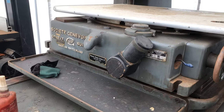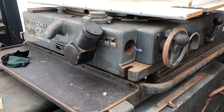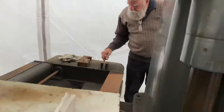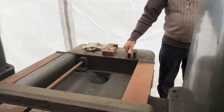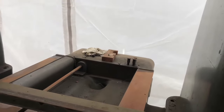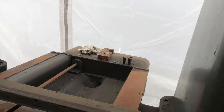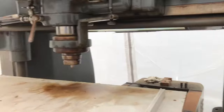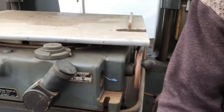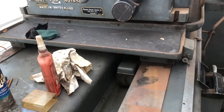Now before I do anything else I'm just going to get a squirt of lubrication, which is down the back here — those three handles, just press them. Now these rusty panels on top are just chip guards. Underneath there will be a finely scraped surface, but you don't need to touch them — don't take those things off because they're spring-loaded up here and you'll never get the mongrels back on again. Spring-loaded to keep them taut, otherwise they'll be a problem.